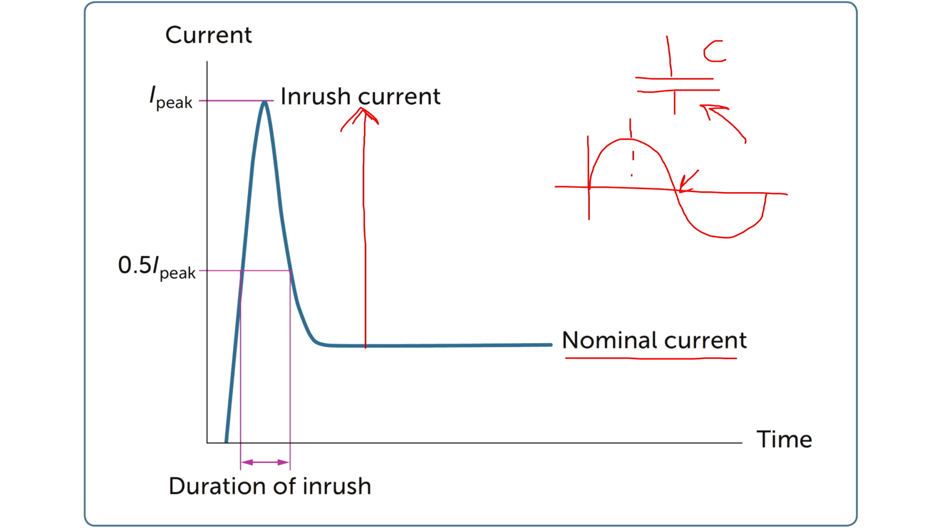There are circuits that you can get to delay the turn on to make sure that it turns on the lights at a zero crossing, but generally people do not have these things and they just install LED lights and then they install too many, and what they found is the circuit breaker trips. I'm going to quickly go through some things to consider.